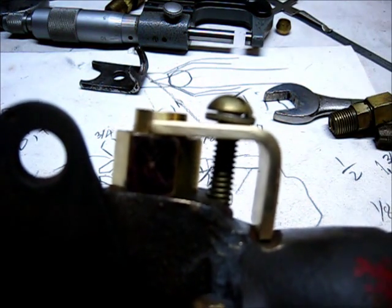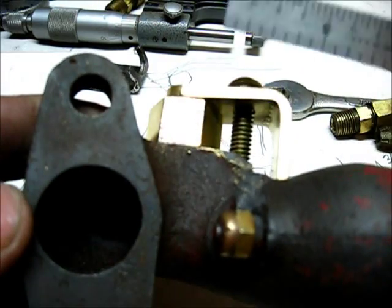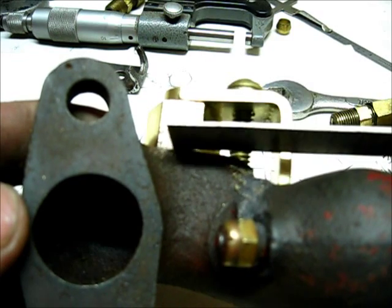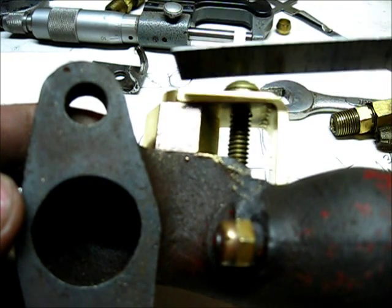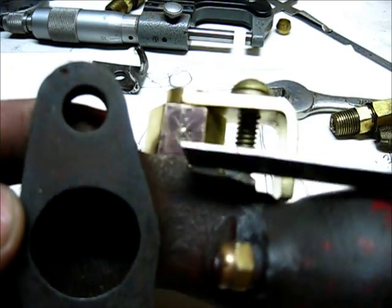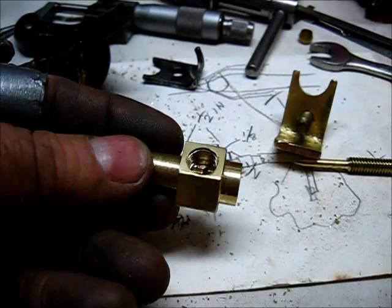As you can see, I want to bring this to your attention - you're going to say it ain't right, you're going to say it's crooked. This is at a small angle down this way, just a very small angle. The reason it's in that position is I'll have to put a gasket right in here. When I put that gasket in there, it'll raise that out and then this will be level again. But you don't want it to be dead level - it needs some clearance on this side so that it will hold it even. If it's this way, it will align at an angle.